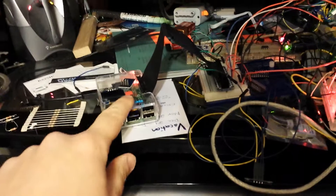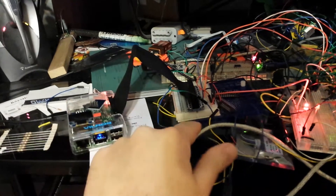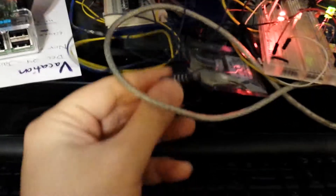Here I've got my Raspberry Pi hooked up to an Adafruit cobbler to this breadboard. This breadboard on one side is hooked up to an OLED, which is dangling over here — I'm not using that at the moment. The rest of it is hooked up to two shift registers: two sets of HC-595 shift registers.